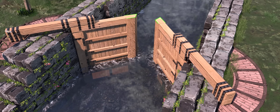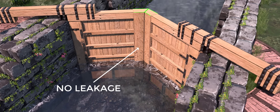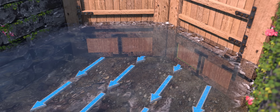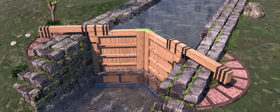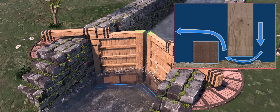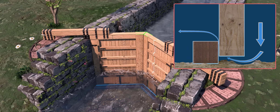The mitered gates design successfully prevents water leakage between the gates. But what about the leakage between the ground and gate? Da Vinci even had a solution for this problem: place a step at the non-openable region of the gate. Please observe the movement of the gate cross-section. Due to the same water force, the gates will almost be able to touch the step, and the leakage through the bottom of the gate will be negligible.